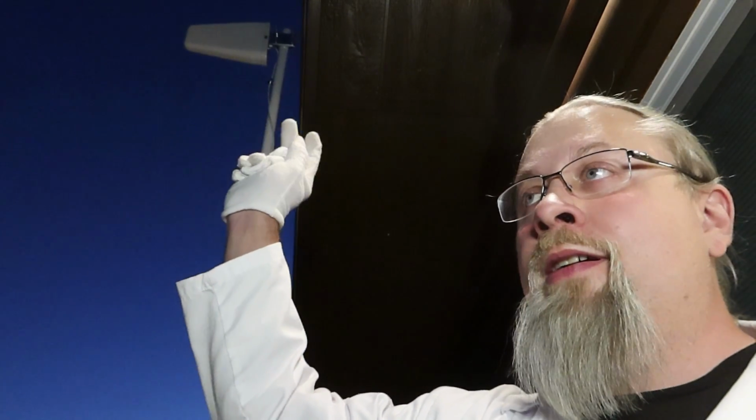So you can see I have the antenna pointing straight out that way, which is incorrect. But you don't want to just willy-nilly turn this thing super fast, but you do want to keep it around 20 to 25 degrees of movement. So we're going to go ahead and rotate this, what I call an 1/8 of a turn, to point it closer towards where I know the cell phone tower is. And that is what I call an 1/8 of a turn, because basically you turn it 8 times, you'll make a full 360. These antennas, they work in that 25 to 30 degree width. So you don't have to have it pointed perfectly at the cell phone tower. As long as you're within 5 to 10 degrees of it, you'll get the full boost.